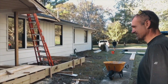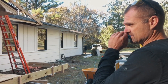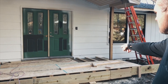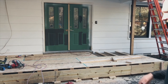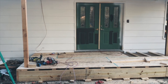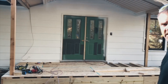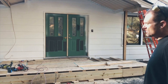I came out here and my honey's gotten a bunch of work done. He got a few more pressure-treated 2x4s and used a masonry bit to anchor them down to the old patio. What he's covered up so far is our concrete patio. He's got four by eight sheets of three-quarter-inch tongue and groove with PL adhesive underneath. That'll set really good overnight, and then it'll get covered with hardy backer, which is what the brick veneer will go on top of.